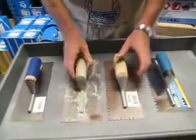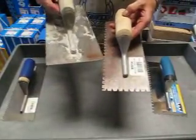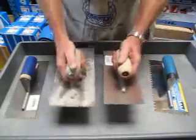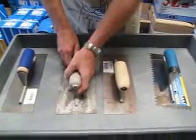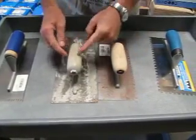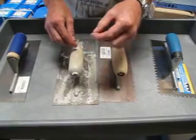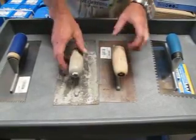This is what happens when you don't use stainless steel. As your trowels are used, they rust. And if they have a wood handle, they get real slick and slippery in your hand. That's going to happen because the wood absorbs moisture, and when it absorbs the moisture, it also absorbs the chemicals in the thinset that make it slick.